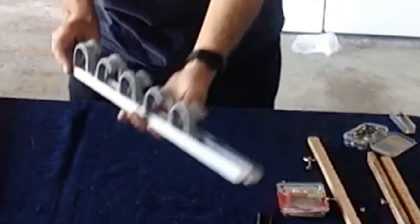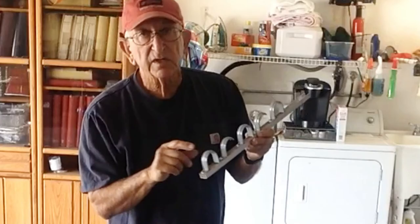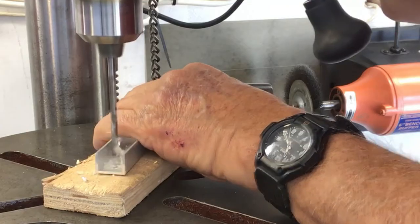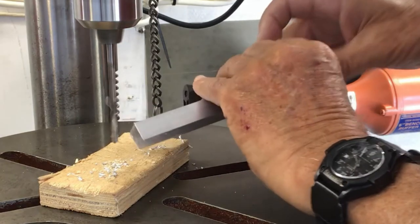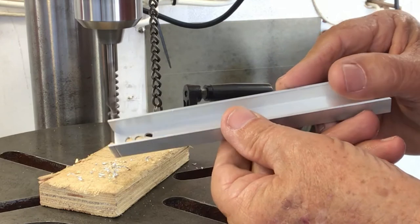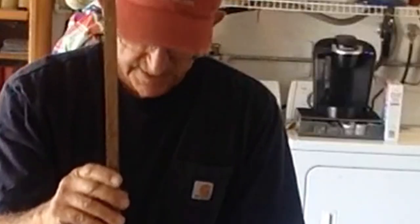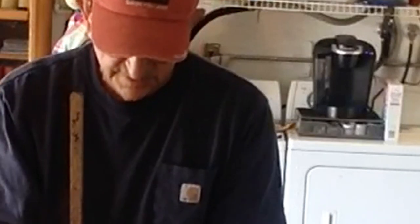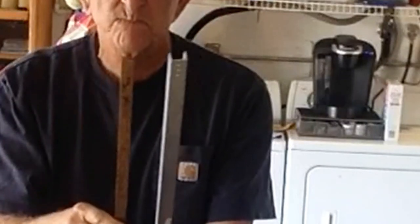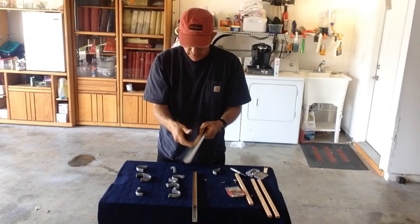The teak is in there now. The next step — I'm going to put little marks here, go over to the drill press, and put in these little ones and then the larger one. Then I'll have it ready to put the screws in. This is marked X — three little holes, marked X — and in we go.